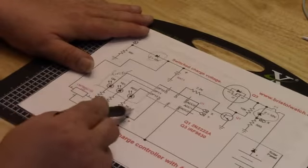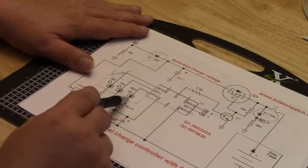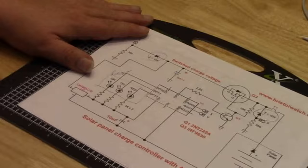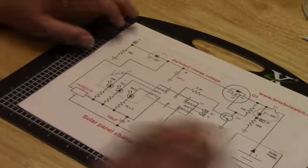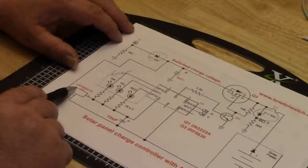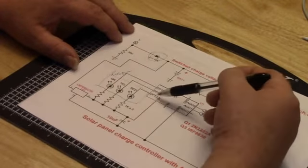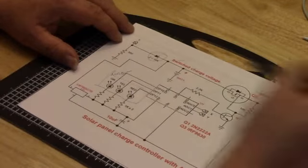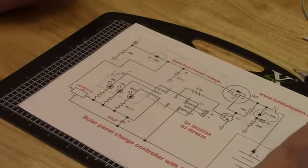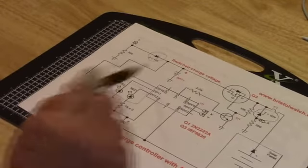But what I have thought about doing is keeping his LED idea for the charging, which would be red for bulk charging, yellow for absorption, and green for fully charged. It's just three LEDs, not that much. The only difference is I'm not going to use a linear regulator here. I'm going to connect all of these to ground, and then through the given data pins, I'll apply a positive voltage and then shift the resistor, I think, up over it. And then using a 1K ohm resistor. I think that'd be all right.